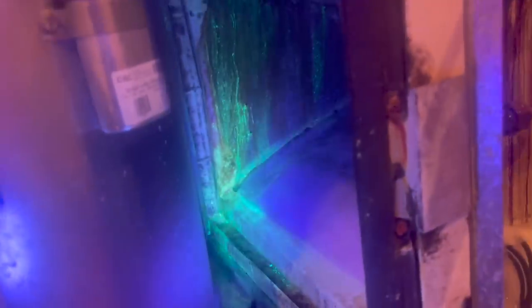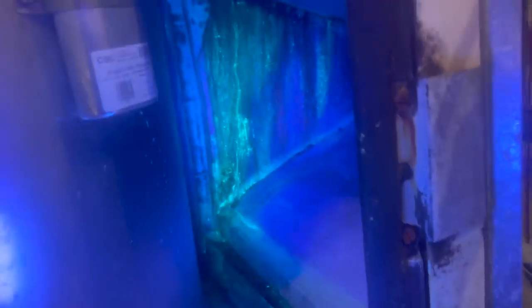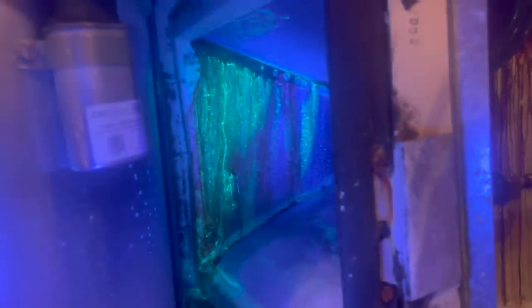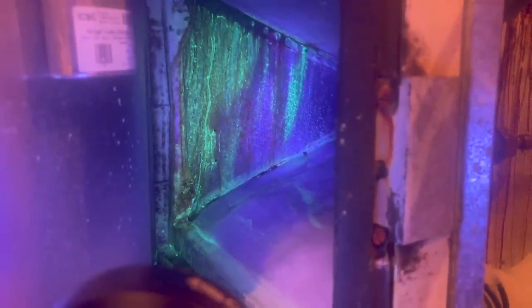We are gonna talk about a new system, because York is gonna want just as much for this coil as I can get an air handler for. And she has a Guardian 407C unit with a month of warranty left. So I think it would be better for her to update the system and get a 10-year warranty, but we'll give her options on a new coil, which I can give her a ballpark on because the York store is closed. And I've already worked her up prices on new equipment.